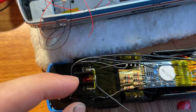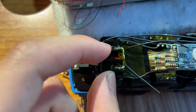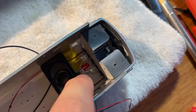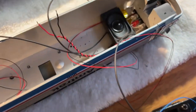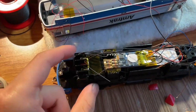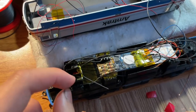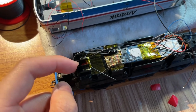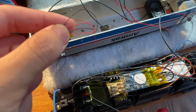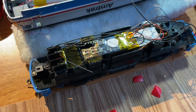All these LEDs are wired up with Kapton tape to prevent them from touching the die-cast frame. All of the positive connections come together, and then the negative wire of each LED has a separate wire, which all connects together. Now it's just final assembly: tying up all the wires, combining the four number board LEDs together, combining the two emergency strobe lights together, and wiring each of the individual strobe's thin wires into the resistors. I'll probably show you the final result before I put everything back together.